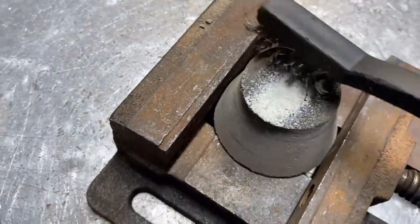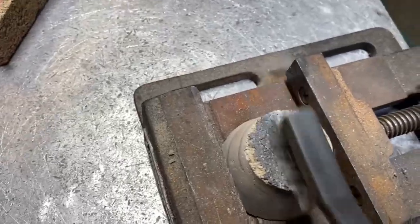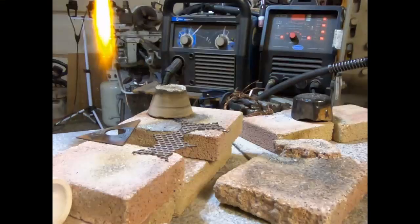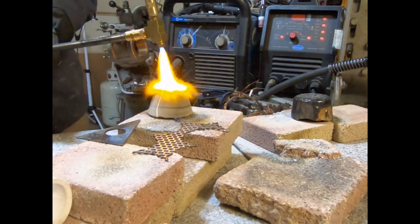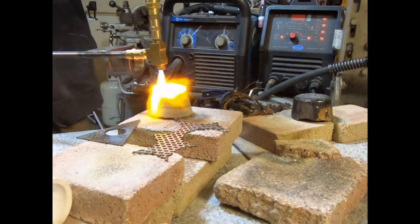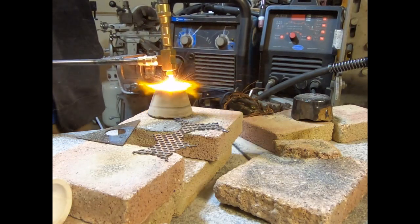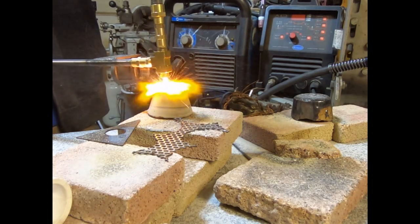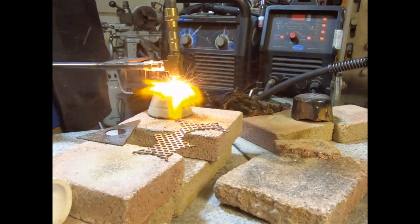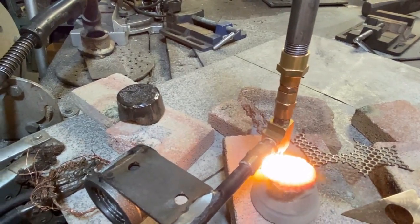I've got a wire brush here, I'm gonna give this thing a good rub just to observe the abrasion characteristics. It is all vitrified material left. I'm gonna give this a try again and cover the entire top of this thing, kind of pretending like I'm putting some type of heat-resistant shield on it. It definitely throws a lot of sand around, but that ain't no big deal. I wish I could get that sand to converge - it's actually spraying out at a right angle on one side for some reason. We're going to have to look at the geometry and check the centerline under a microscope to make sure I'm properly aligned. Here I am running over it with the torch with no sand just to vitrify that last layer. Boy is this stuff bright.